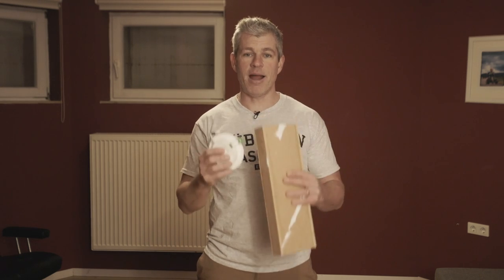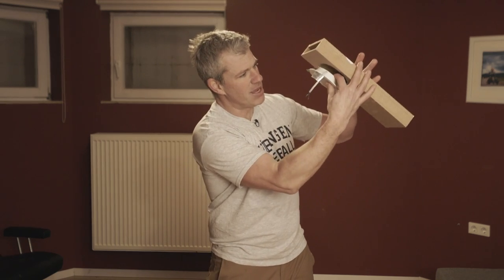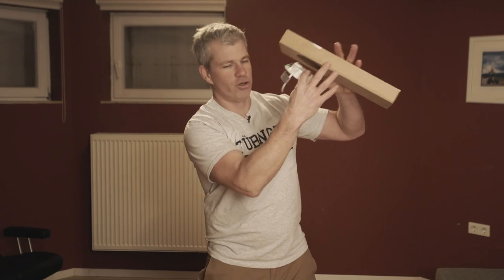Welcome back to Holtzfelder Woodworking. I'm Alan — it's been a while but I'm back. The lighting in my house is terrible, so I'm going to fix that by installing low-profile LED recessed lights everywhere. The problem is the ceilings are made of cement, making it nearly impossible to run wiring. So I'm creating a coffered ceiling look with fake beams and trim, with lights mounting directly in the beams and wiring hidden inside. I whipped up a prototype and everything works fine.